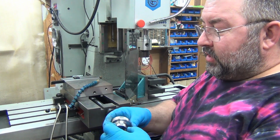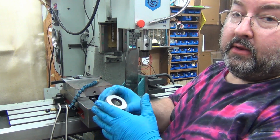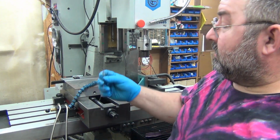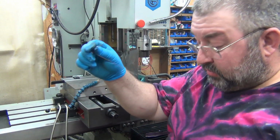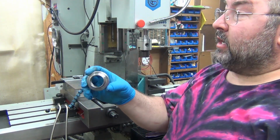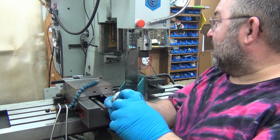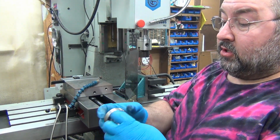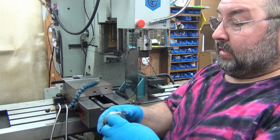But it'll change every time. So when it does the first few cuts, they're definitely thinner, and you'll see the chips are a lot lighter, but then it starts cranking out some pretty heavy chips. I was putting out some way heavier ones, but it was stalling the spindle trying to do a 0.025 depth of cut. I kept thinking maybe it was slipping or something like that. It literally just stalled the spindle. The servos kept going. I've got some other pictures of that where it just shoved the cutter right through the metal.